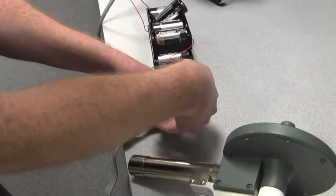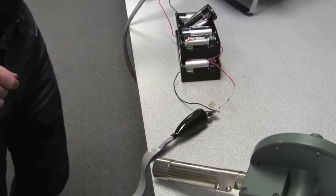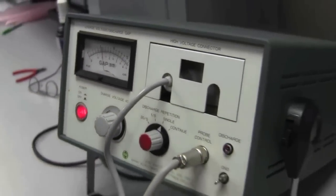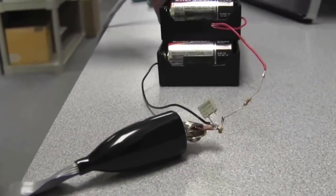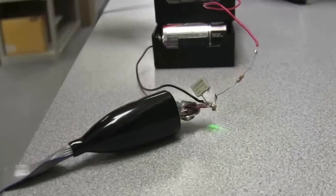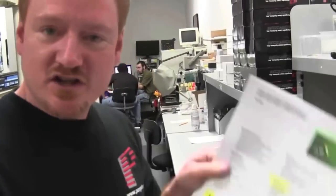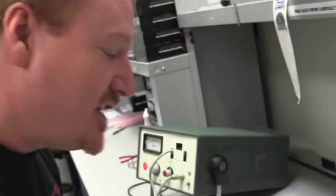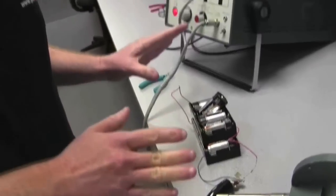Now let's do something a little bit different. We'll cut the Laser Orb off so it's no longer offering any protection, and I'll turn the ESD gun way down to around 6 kV. On single mode we're just going to give it one shot of 6 kV unprotected and see what that does. As you can see, these green laser diodes really are sensitive to ESD — the data sheet gives us a warning about that. Sometimes we ignore these warnings, but in this case it was true. And as you can see, when you protect the laser diode with Laser Orb it can survive practically anything.